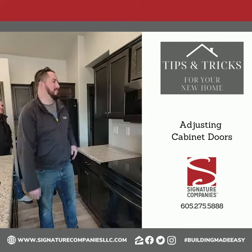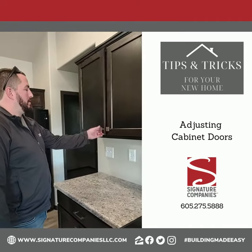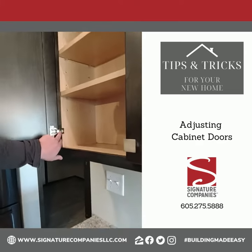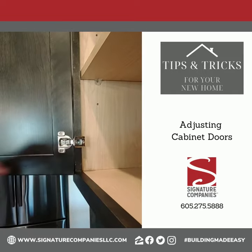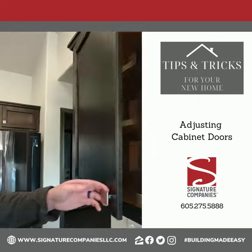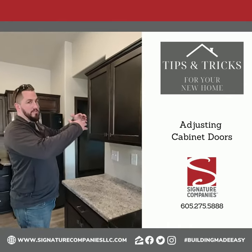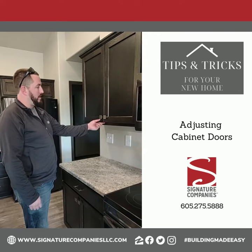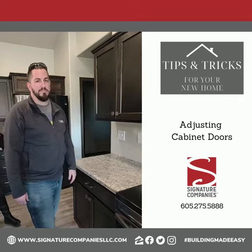We'll do the cabinets. Any of your cabinet doors that could possibly rub together like these — our hinges are very nice. The front screw is going to pull your doors closer and away from each other, and the back screw is going to pull them closer and away from the frame. Over time your doors are going to drop and sag with humidity levels in the house. They can swell up, they can shrink. So if you ever notice them getting unlevel or you feel that rubbing, do some quick adjustments on the hinges just to keep your doors looking nice.